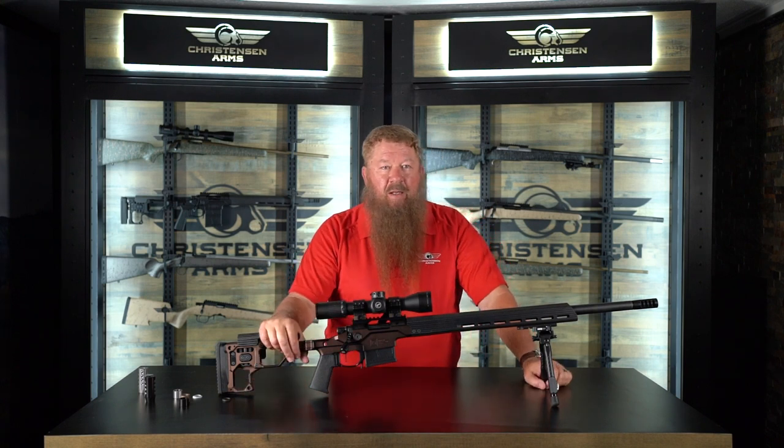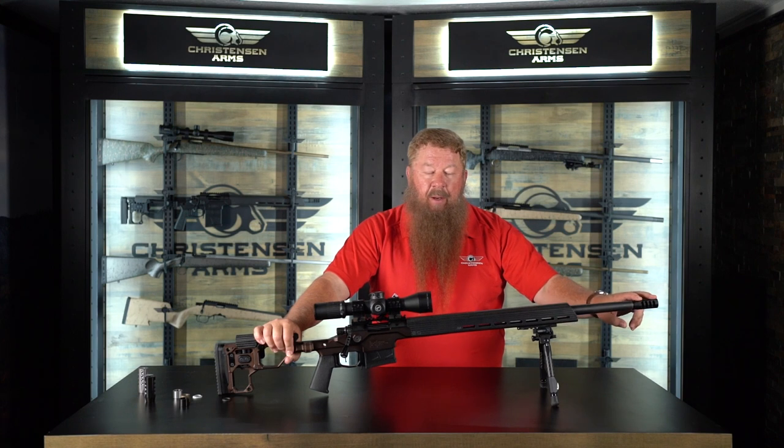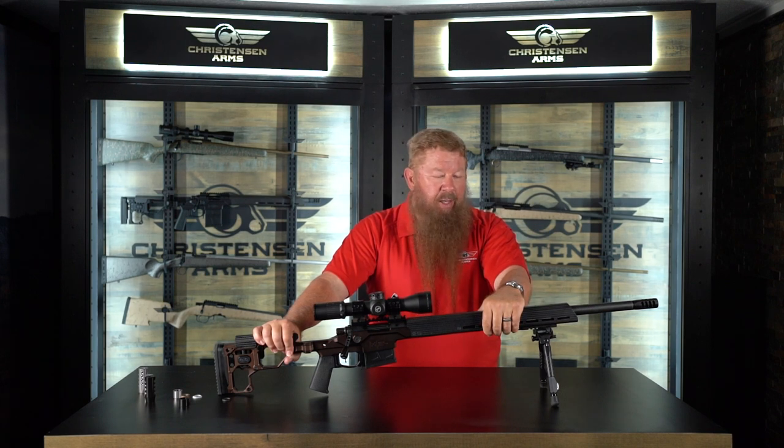So we've talked about basically the muzzle brakes to this point. Let's talk about the caliber of muzzle brake you need for your application and the thread pitch. We've mentioned already 5/8-24 on the carbon barrel guns and 1/2x28 on the rimfire and even the 223 caliber guns. For example, the modern precision rifle chambered in 223 will have a 1/2x28 muzzle thread on it. Both of those threads are widely adaptable for modern suppressors. If you've got a 5/8-24 suppressor, you can easily buy an adapter to adapt you down to the 1/2x28 threads so that you can run a suppressor regardless of those two thread patterns.